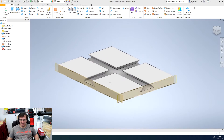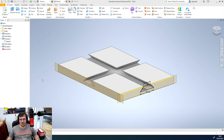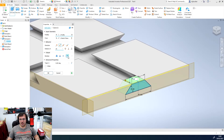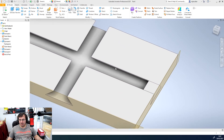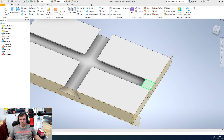Now we're going to make this mechanism where one part slides up through this section and another slides across, and they're attached by a handle. We want to create the two sliding objects. We've already got the sketch, so we'll make it visible and extrude it 20mm as a new solid body. In the assembly we'll just copy this one, and because all the dimensions are linked it will also move correctly.